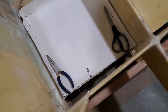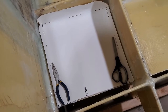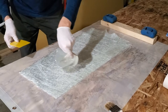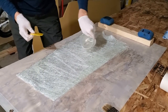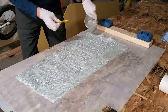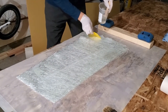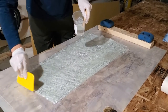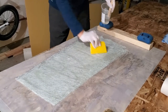Here's the template in the sternmost compartment. I'm just going to do a thin string of epoxy across this. Using an old Starbucks cup as my mix cup, I'm going to cover it up and follow it with a squeegee to spread it around.